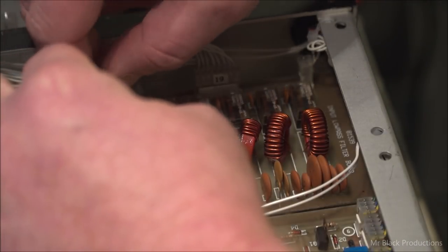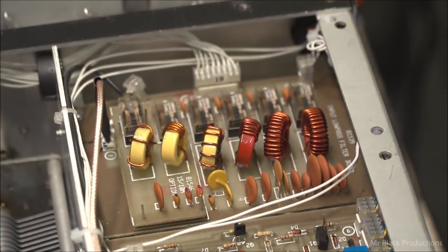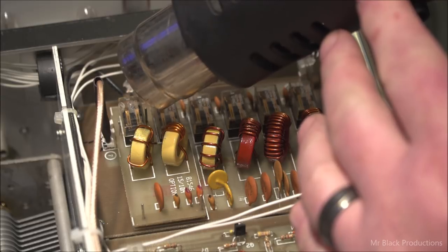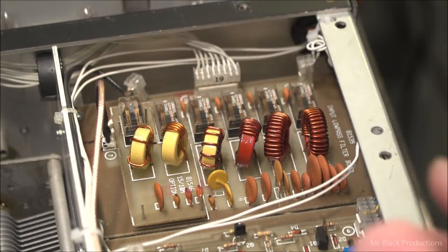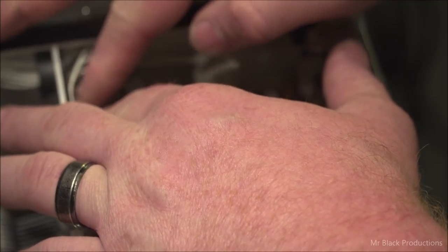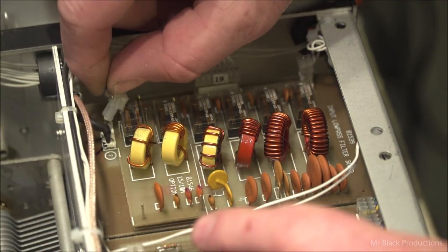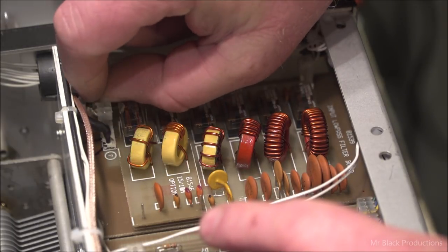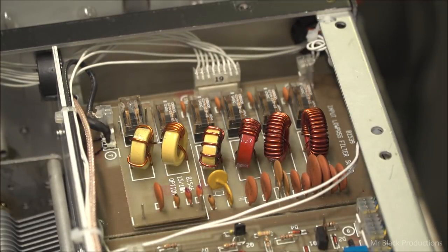Squeeze those two together a little bit. Now we'll work our shrink down onto the connectors, like so. You cool down, let you form fit to that connection. Torqued in that direction. As soon as the epoxy and the heat shrink sets, it's never gonna move. See, this way, I don't ever have to worry about any foreign body coming in here and giving us a hard time about nothing. No shorty action on the coaxial actions.